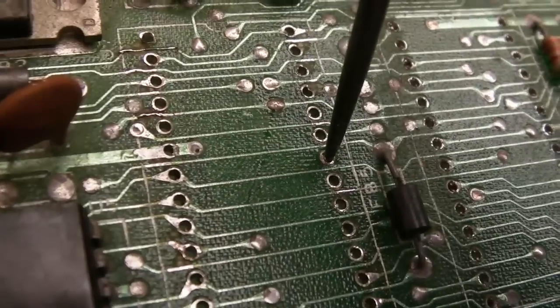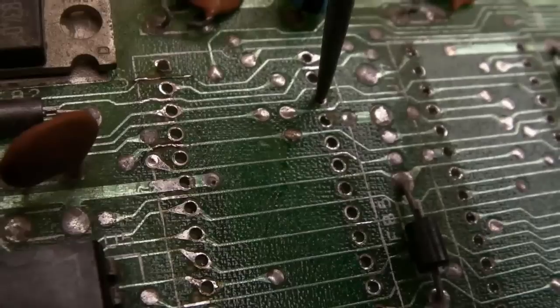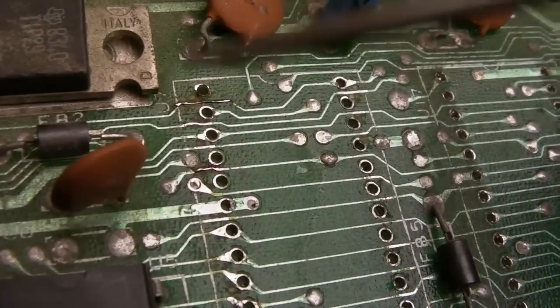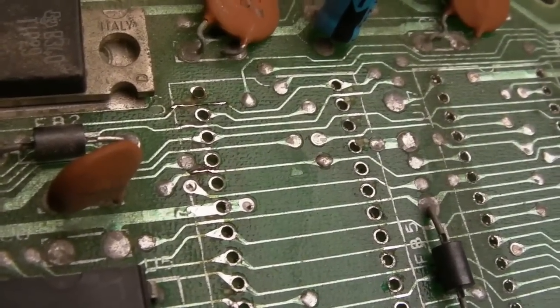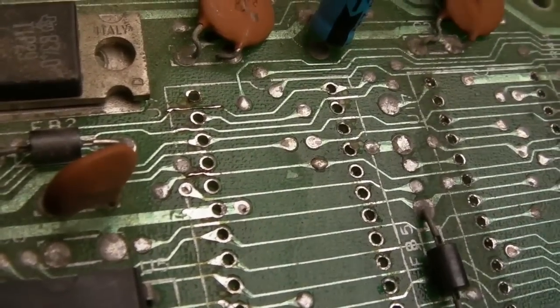So yeah, one or two of these, as I say, they're not spherical. So just a little press. The gaps are sufficient though. I've checked, there's no solder blocking. But we should be able to get a socket on there now. Not even going to put any nail polish over those. They're going to be fine as they are. And I've tested connectivity from the side over there to the side over here on each of those.